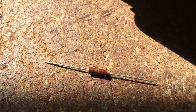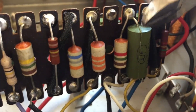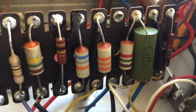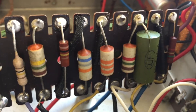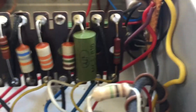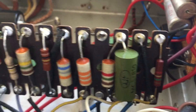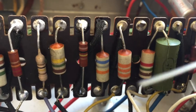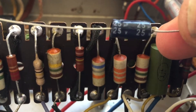This green thing here is the bypass capacitor on the second stage on the cathode. It's very small — it's 22 nanofarads. We're going to replace it with 25 microfarads in order to get some bass back into the circuit.